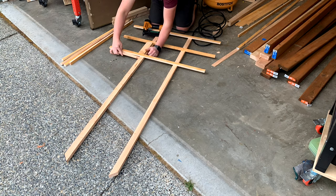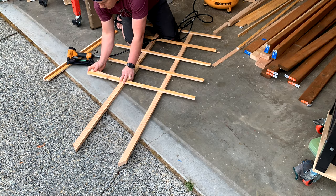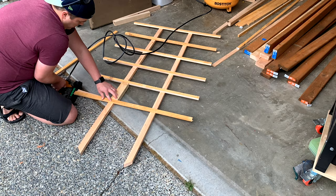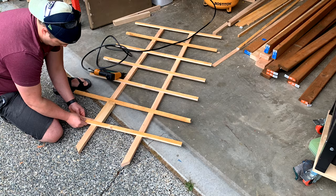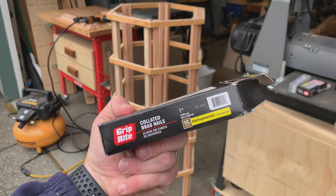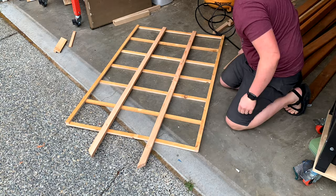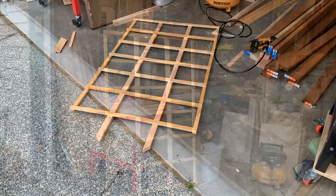I also have another piece just to account for how far off it goes, just to center my posts. Having those story sticks — those pieces of wood that give you uniformity — really does help; it makes the project turn out and just look that much nicer. My spacer is about eight inches tall, and the horizontals are about 11 inches off from the center post. Then taking some more of those pieces, go to those one-inch nails at this part — just going into the fence material. Add your lines and you've got a pretty standard basic trellis.